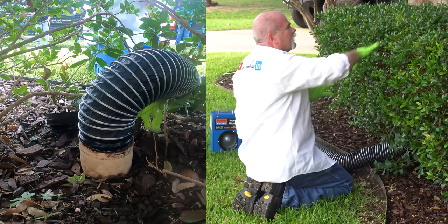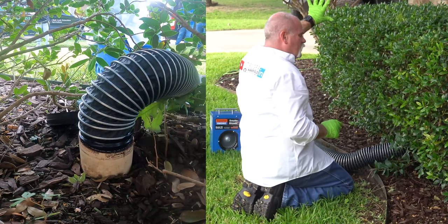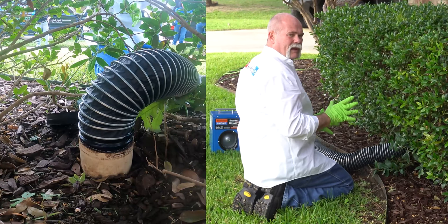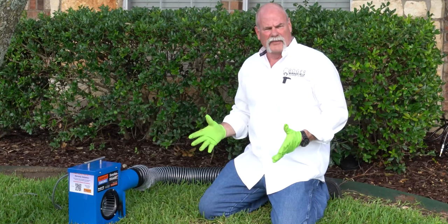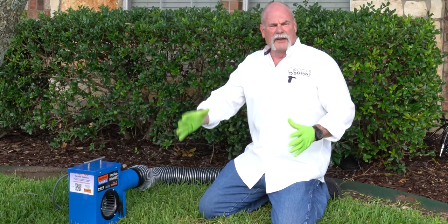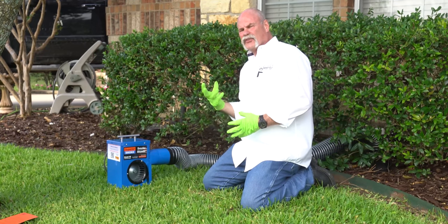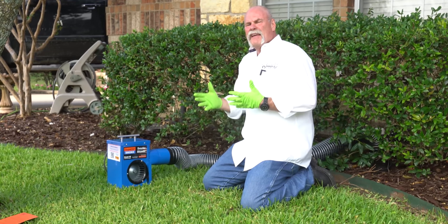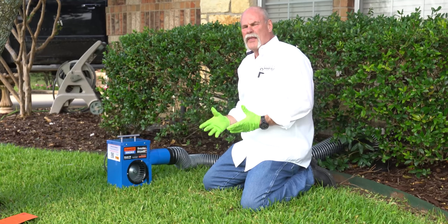My whole purpose here is to get smoke into the house coming up the vents. We'll set a camera up to show you the vents here. There's one around the backside we'll go look at in a minute, but then we'll go through the house once we get everything set up and get it going. So what we've got is the Superior Smoke Model 5E. This is great for residential, and it can also be used for small commercial. They do make bigger models if you're testing mains or something like that. I like these machines because I can induce the smoke down low and watch it come out the vents above. Once I know that's done, if I really wanted to try to create any pressure in there, I could go up and cap off some of these, but I'd rather not do that.